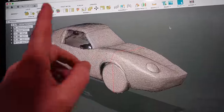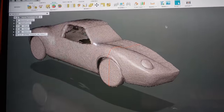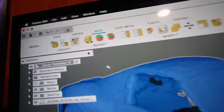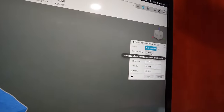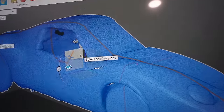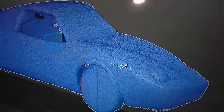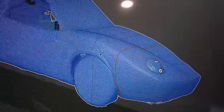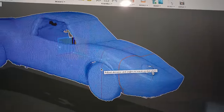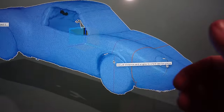Here's a little pro tip: if you're working with a mesh and you want to take profile cuts to make 2D templates, select your mesh, go to Create and hit 'Create Mesh Section Sketch.' Then choose your section plane after selecting the body, make the plane perpendicular to the car, and drag it along to choose what section you want. My plan is to start my first loop through the center of the wheel so it's easy to locate on the car, then measure a certain distance between each one for front and rear.